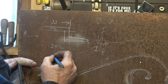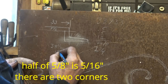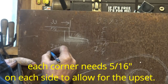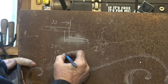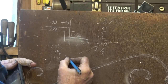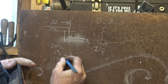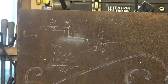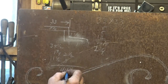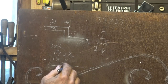So we're at thirty-eight and a half. We need another ten-eighths of material — which would be one and a quarter inches — plus an inch and a half there. And this has to be doubled, so that's the same thing at each end. I'm thinking out loud here, so I'm sorry if I'm confusing you. That's really two and a half inches total for that, and three inches total for this, so thirty-eight and a half. I quit rambling and did this quick to make sure I'm right. If your grill is a different size, this has to be your number, not my number. So I'm going with forty-four inches, and this is an estimate at this point.